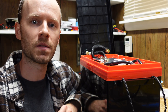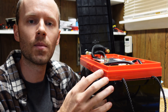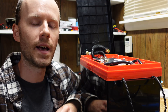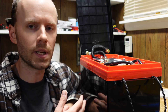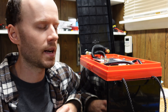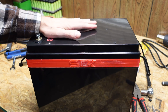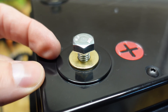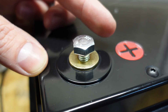It's worth noting that the manufacturer let me know they're working on a new version of this kit with a custom-designed lid that does not require the spacer piece, so there will be more room to route wires or use different kinds of cells with studs versus drilled terminals. The intent of this kit is to be a DIY build, so you can do it the way you want — everybody's going to do something a little differently. Maybe you don't need this much power and can get away with two number eights instead of two number sixes or just a single number six. Basically, design it to fit your specific use case and needs. The case is reassembled, looks fantastic and as solid as before. I also picked up some M8 bolts at Lowe's and threaded those in the top for securing cable connections to the outside of the battery.